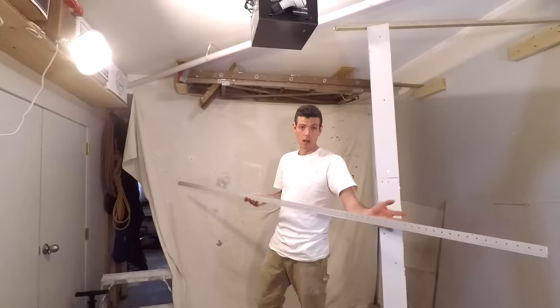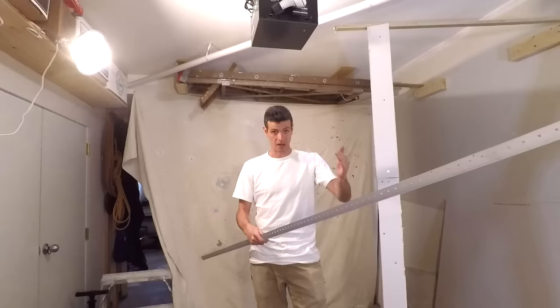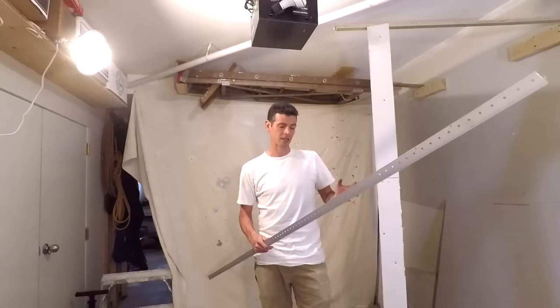Also, when you're purchasing steel beads, it's a good idea to look down the beads before you buy them, because it's really common for them to be kind of bowed. You can wind up with your bead being twisted after the install without understanding why, and it's because it already had a natural twist and it just followed it without being corrected as it was installed.